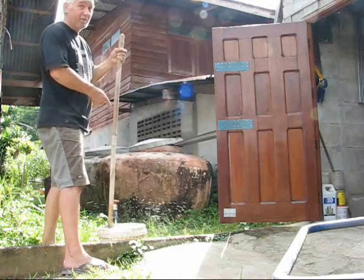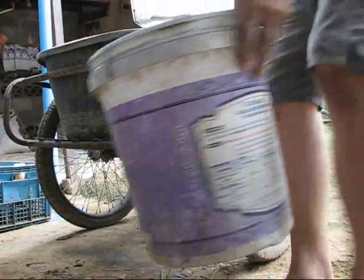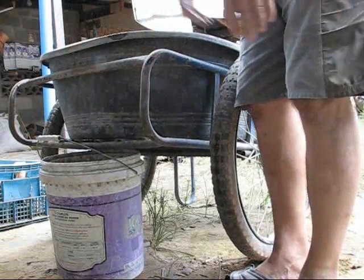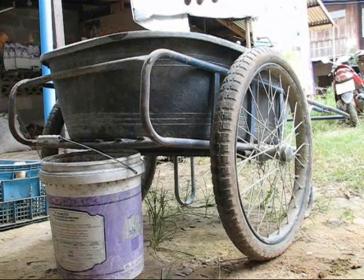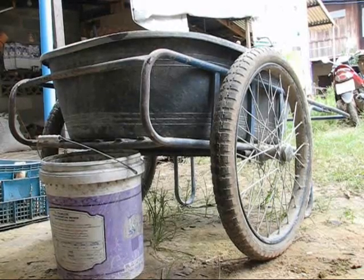That's where this handy utensil comes in. Okay, the bucket gets temporarily placed underneath here because there is a tipping point. And I first have to mix the cement and the dry sand thoroughly before I add the water, so it can rest right there and protect me from spilling the dry mix all over the place, which I think I've only done about 4 or 5 times.